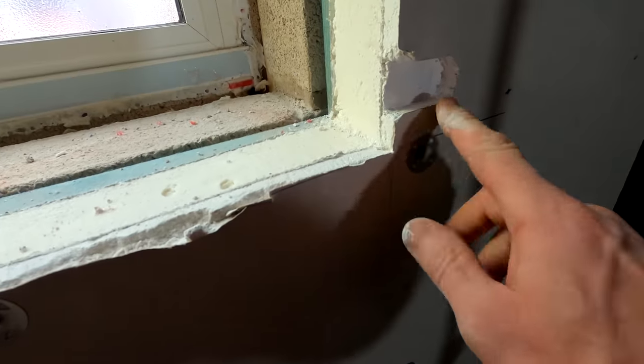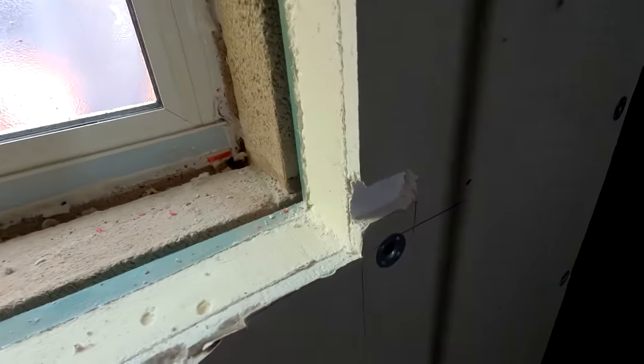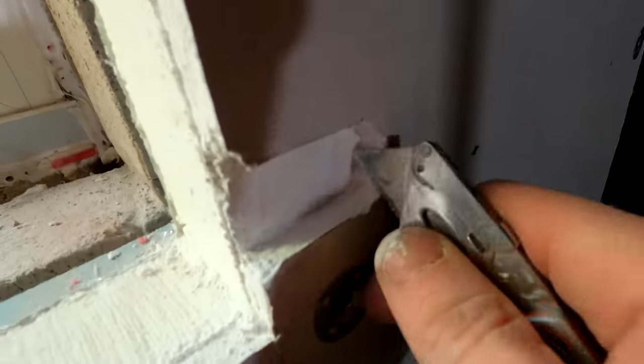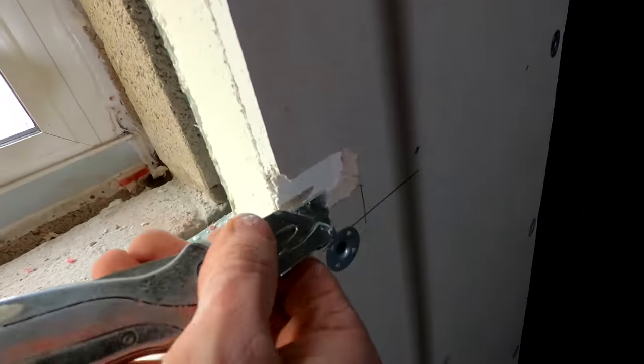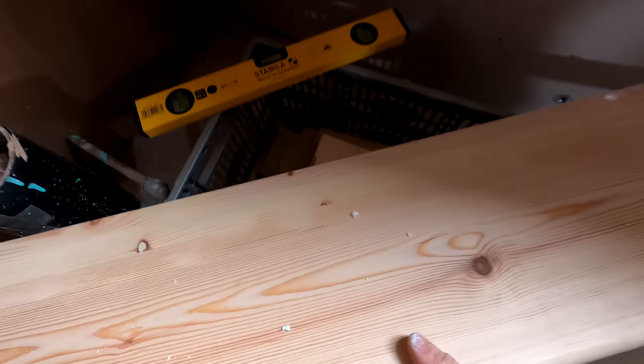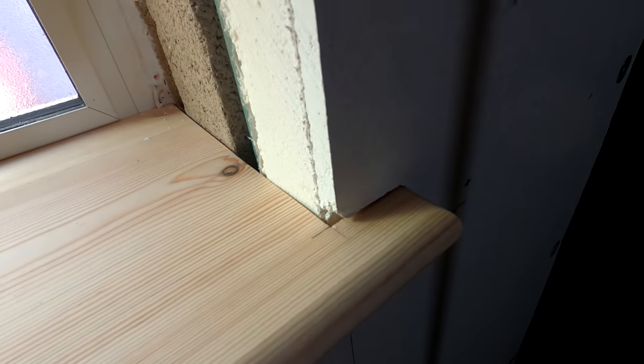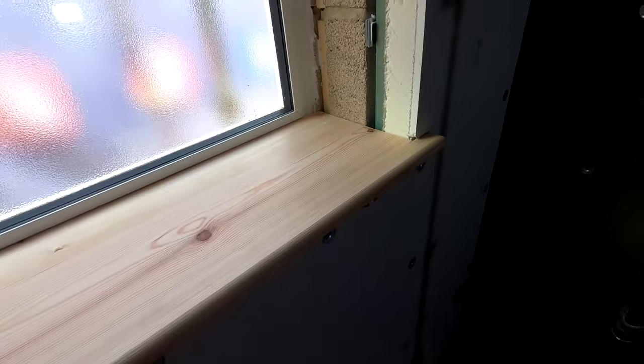What I've done is basically just marked around the horns of this sill board in here with a pencil, then used my knife to basically cut it out nice and neatly, and then used the flat of the blade to carve it out. So then when I come to the sill board it can sit back in nice and tight, just behind the face of the plasterboard. Once this is all fixed in it will keep it nice and snug, and when the plasterer skims and plasters it in it will all be covered over and be part of the wall as if it was meant to be.